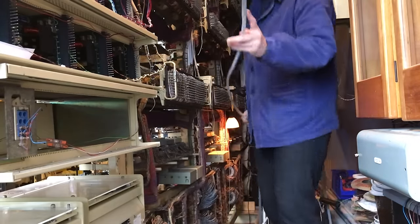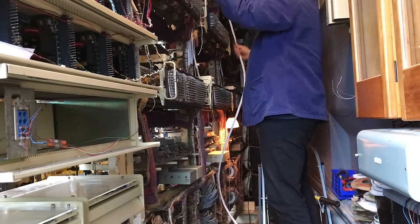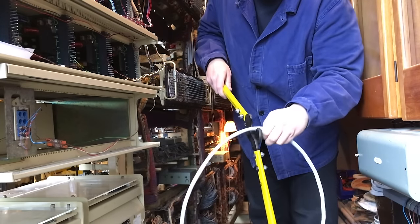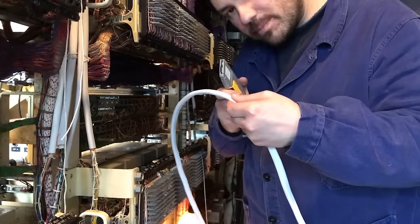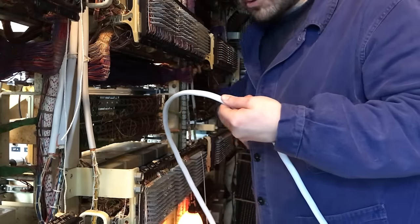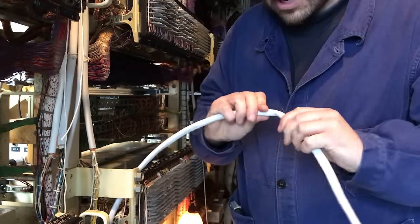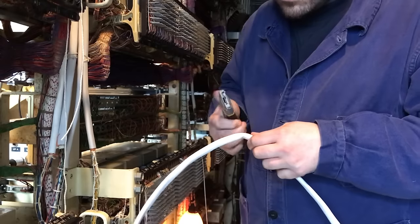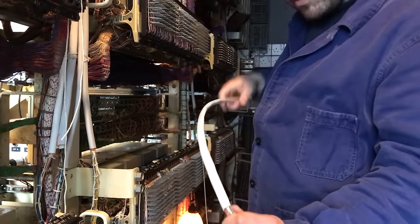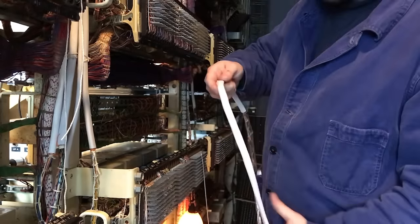I'm not an expert, I'm just at the museum, so go easy on me. But I'm always happy to have helpful comments down below. First step is to cut off a length of 20 pair — about there. That will easily take your finger off so you've got to be careful with that. Now what I need to do is strip the sheath off of the cable. You do that with a knife — score around the edge of it, being careful not to go all the way through because you don't want to nick the cables by accident. And then you can just break it open like that. And there's a nice little bit around the back to get. Just gently score it there and you can break it open. I'm just going to do that again halfway down and pull the sheath off in two halves.